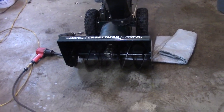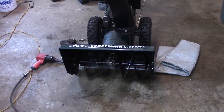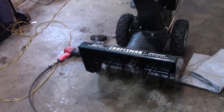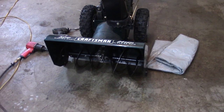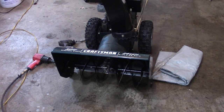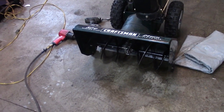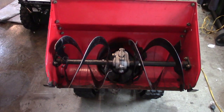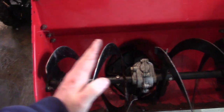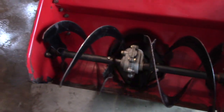On the right-hand side the blades are bringing the snow away from the impeller. According to the guy I got it from, it actually came from the factory this way, and he's always had problems with it. By looking at it I could tell that the right side auger is the same as the left side — same part number, but they're supposed to be different parts. I'll show you another blower. You can see with this one — it's an Atlas — how one side is angled to bring snow towards the impeller, and the other side is angled to bring it towards the impeller too.